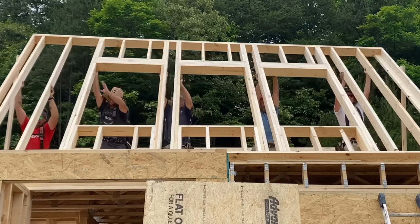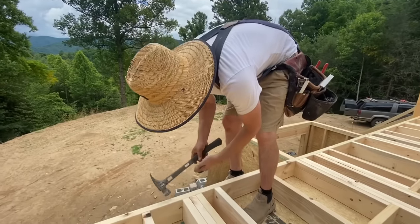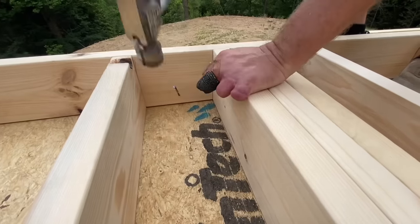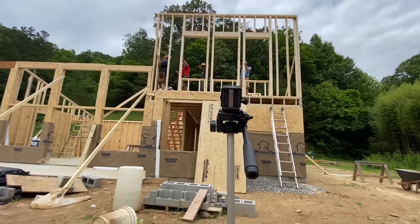This was another big wall and I hated to miss out on lifting it, but someone's got to videotape this stuff so you can watch it. The reason the bottom plate of this wall wasn't sliding off the subfloor as they lifted it is Jamie had tacked it to the floor with toenails. It's so important — if you don't want your wall to slide, this acts as a hinge so you can stand the wall safely.